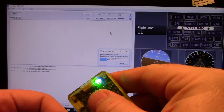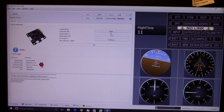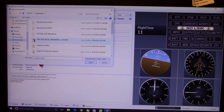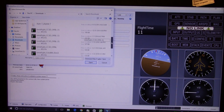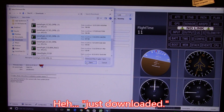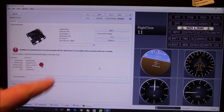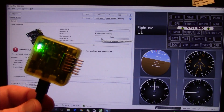Go ahead and connect the board, and it brings you up to this window. What we want to do is take the Betaflight firmware we just downloaded and put it on here. Click Open and go to wherever you saved it. I have a whole bunch of these downloaded because it keeps releasing new versions. Here's the one I just downloaded — I'll go ahead and click Open. Now it has this big red circle warning that says this is not software being provided, but go ahead and click 'I know what I'm doing.'